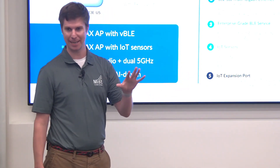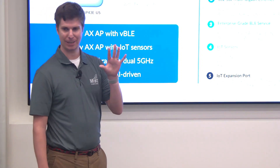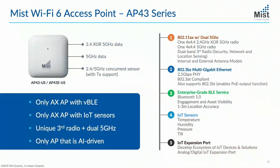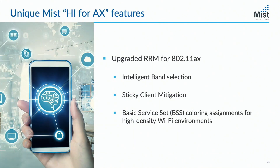I love hardware as much as the next guy, but for MIST it's all about the software. This AP and 11ax are more of a data source for us — for MIST it's all about the data. 11ax enables a number of new vectors to have a better RF experience. New to MIST is dual 5 GHz, so we need an algorithm that does 2.4 cancellation. We'll take into consideration whether there's enough 2.4 coverage, and we'll never do more than 50% of the radios in a particular location in dual 5 mode.